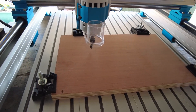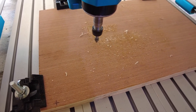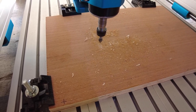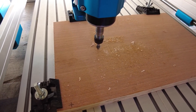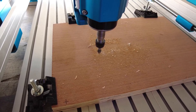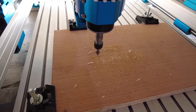There the machine goes. Here we are when it's cutting. As I've just been saying, the terrible noise you can hear is not vibrating from the machine — it's the cutter. It's a very poor cutter; it's only got one real cutting edge cutting at once, and the other one is way off. But it was a cheap cutter.